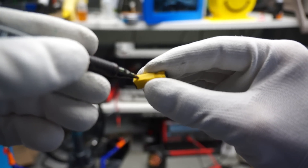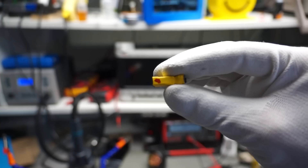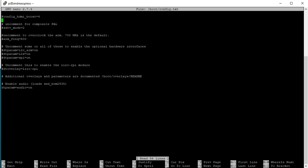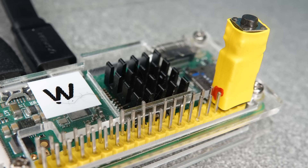As an additional step, I suggest adding a mark on the side of the switched pins. Now it is ready, and we can put it on the pin header of the Raspberry. Only connecting the switch is not enough. We have to change the config.txt file using this command, and add the following line to this file. Then press Ctrl+X and yes, and after reboot it should work. And now you also see why I used 3-pin shells. Our newly created reset switch can be mounted flush with the end of the Raspberry header. Like that, it is harder to get it wrong.